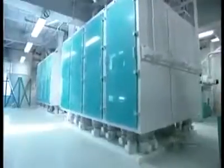Between each milling station is a purifier, a machine that uses controlled air currents to float the lighter bran above the heavier semolina, enabling sieves to separate the two components. The semolina goes through repeated grind, sift, and purify cycles until it's completely clean. Only then can it be finely ground into flour.